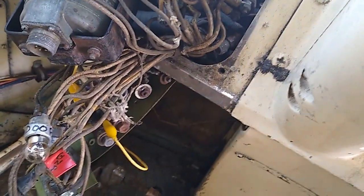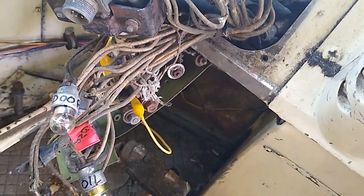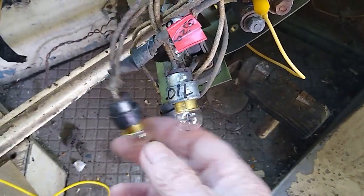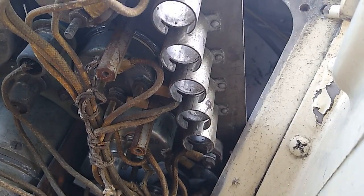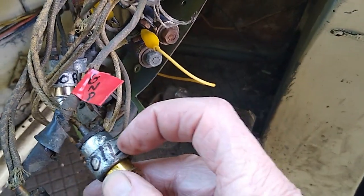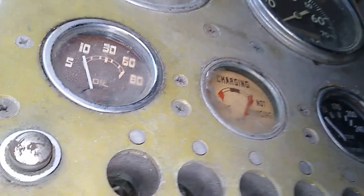I'm not going to disturb it. You do have to handle it carefully — it's rubber wire covering with cotton covering over the wire covering the wire. This is the cluster of resistors and lights, the alarm lights. As I have repaired these circuits, I am marking these lights so I know where they go back into the panel. This area of the light slides into a sleeve and it illuminates a panel on this side.